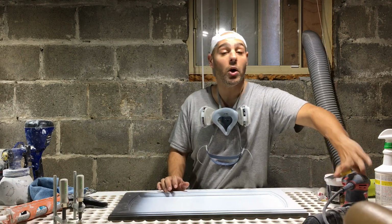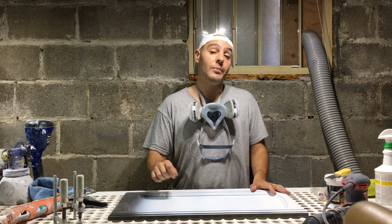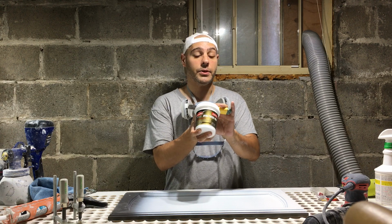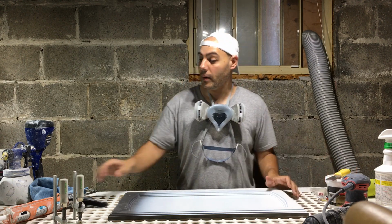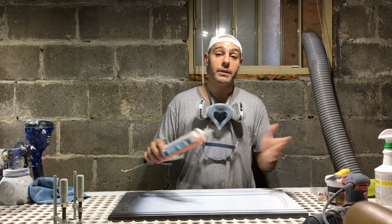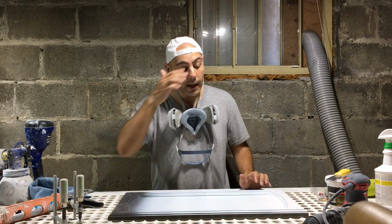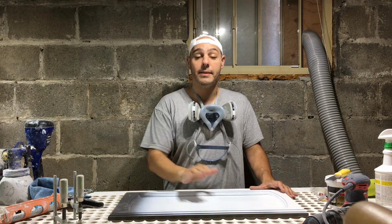Very important to check all the doors and drawers for repairs. You may have some scratches, you may have some scrapes, you may have some dents. So I like to use Dyna Patch for my filler. It's a great filler for wood and metal. And from there, we may have to do a little bit of caulking, inside the seams or any gaps or any cracks that need filling. We like to go with a good caulking. From there, once that's all dry and set, we'll check over everything, we'll hand sand our patches, and it's on to primer. Tino, what kind of primer do you use?